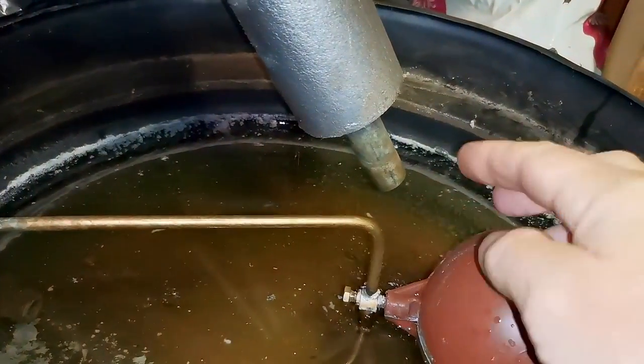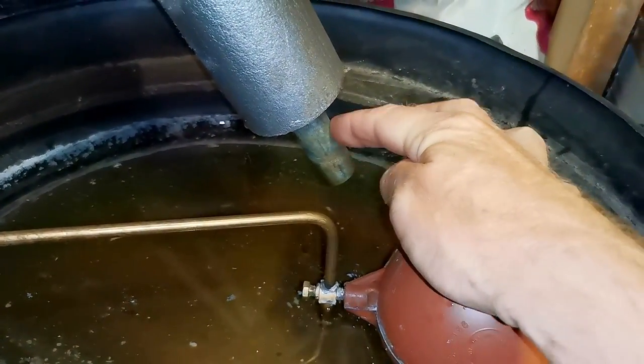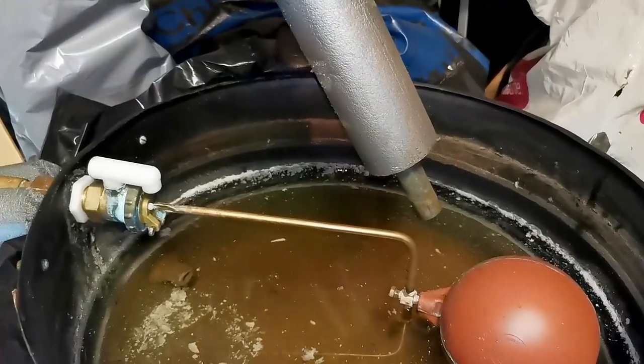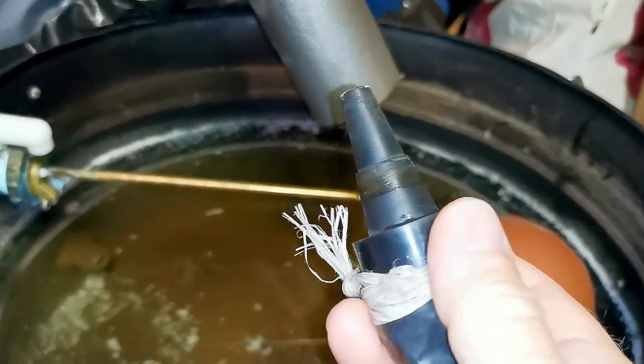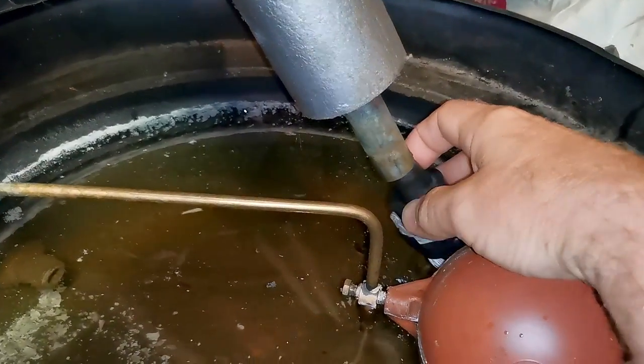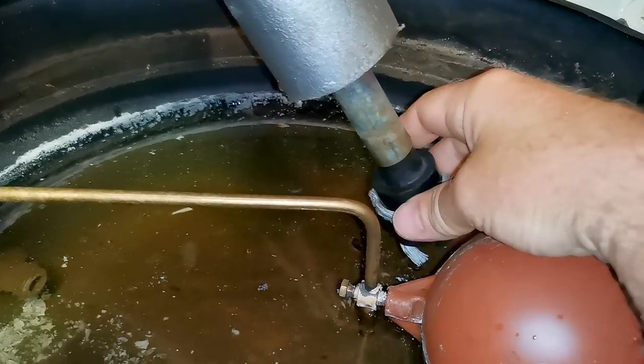Here's a 22mm tank connector — you can see the two lugs are on the outside of this one, and then the bung will just go in there and block up that hole nice and easily, so no water is going to be running past whilst you're trying to do the job. Now I just need to cap off or bung up the open vent pipe. If we leave this pipe open you will get air rushing straight down that pipe and then you'll get water pouring out whilst you're doing the job, so we definitely need to plug this up.